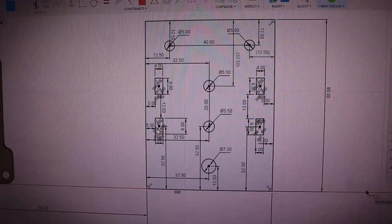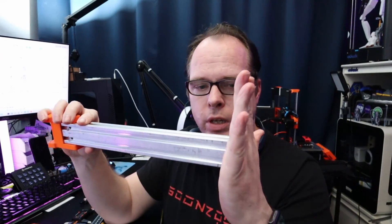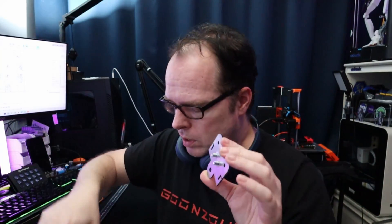I know I said I was going to do this in TinkerCAD, but I also learned to use Fusion 360 - why not use that while doing it? You learn more by doing it, right? It is very complicated looking at this here, it is looking very sketchy. It is actually the base plate where I'm going to mount the X arm to the Y axis. Based upon this principle, using V-slot rollers, I made it a little bit bigger so that it can house the 2040 aluminum extrusion.